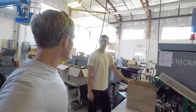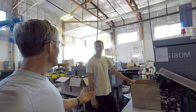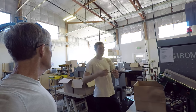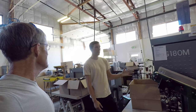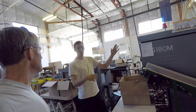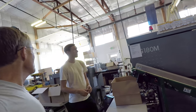Back at your computer, you're working on designs and you have 3D printers — so you can come up with an idea, print it out, which is a slow tedious process, but you get to work the bugs out. You get to test fit stuff, know if it's going to work, see if anything's too weak, if it's going to break or not fit. The 3D printers are great because you can make one at a time without investing in a mold. After you get it all figured out, then you make your mold and invest the money in that.